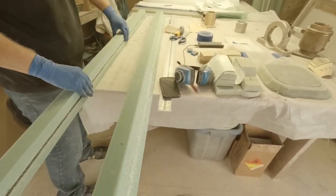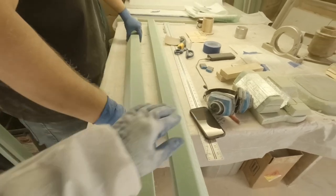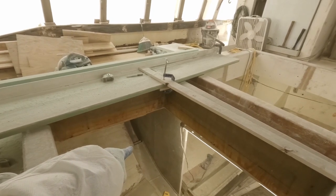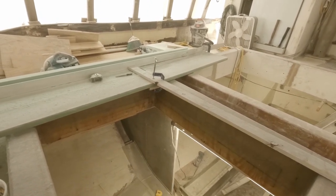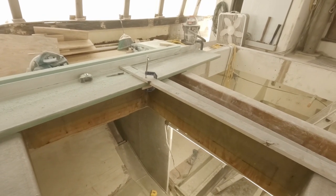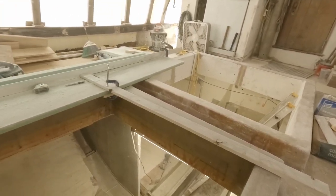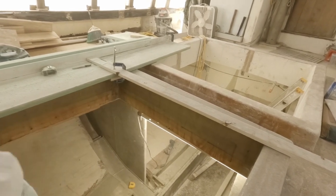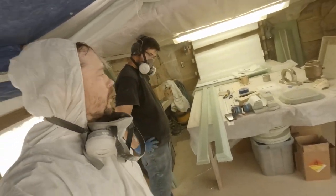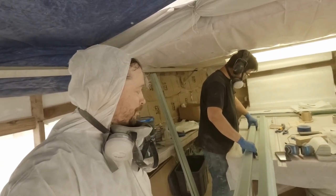So, assuming that this table right here is our bulkhead that's straight up and down, as in that bulkhead right there. Our concern is, even though this is going to be very strong, two layers of 1-inch foam with a 1/4-inch web in between, 1/4-inch layer of glass on each side, this fish hold will be full of water when we tank down. So we've got to make sure that we're not going to blow this bulkhead out and not only have a catastrophic failure of a bulkhead, but risk losing our vessel as a result.